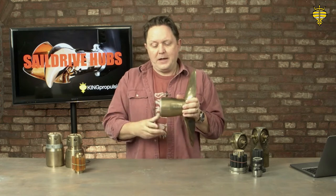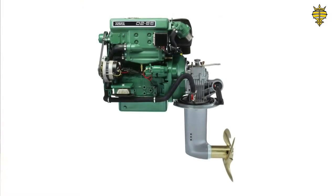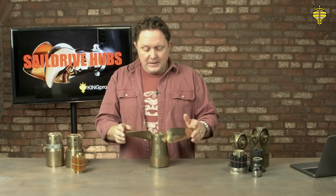The big thing that propellers have to comply with — and this is not something we push — is the damping mechanism inside the hub. With a shaft, if you hit something it'll come up and chances are it'll hurt the mounts, but everything else in the shaft line is pretty robust. With the sail drive it's not quite the same. The sail drive has a bevel box with a fine-tooth mesh gear system — it's like a Z-shaped system — and what manufacturers found early on is that if you hit anything, the blade strikes but the engine won't be moving at the same speed, so you get slippage on the gears and you can strip teeth.